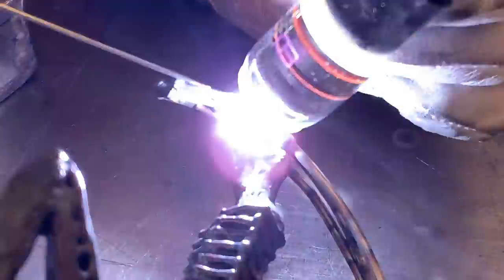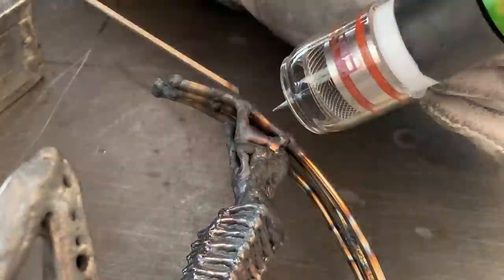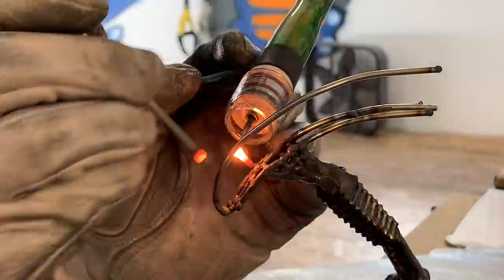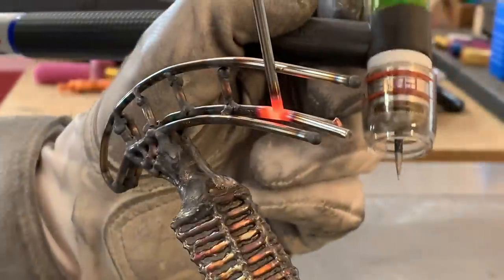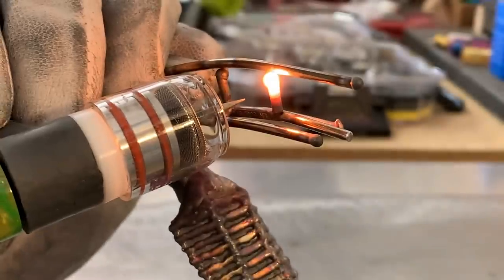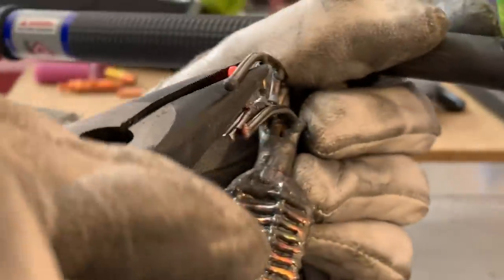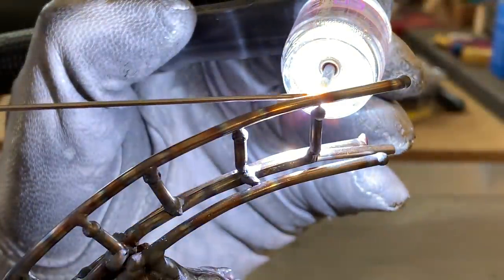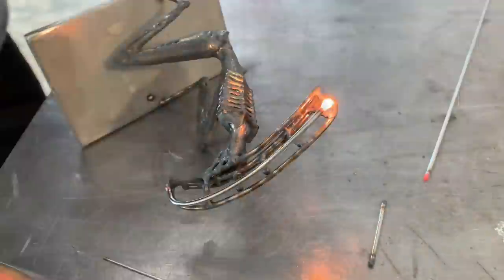Tendons and gaps in the throat were starting to look pretty awesome, so it was a lot of fun to see it come together. This is just a really rough guess to make the shape and size of the head — most likely I'll be readjusting as I go. I'm basically just tacking points along the length of the head to keep the shape supported as I build and fill it up. The head will be hollow, so I want it to be strong or else the heat will crack the finish as I grind it to shape later.